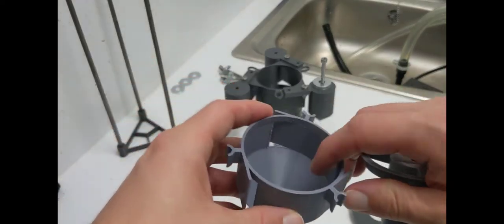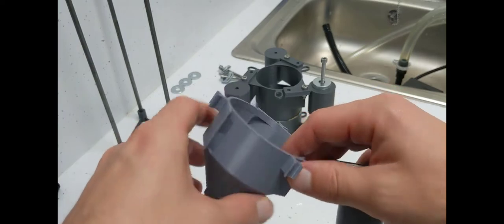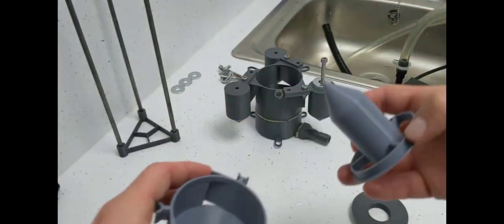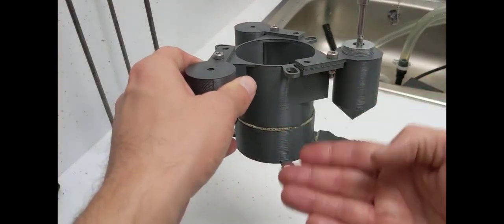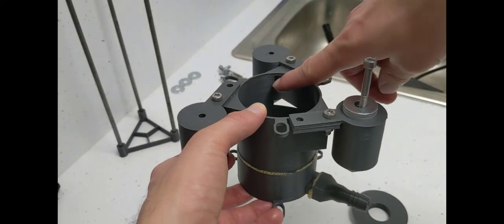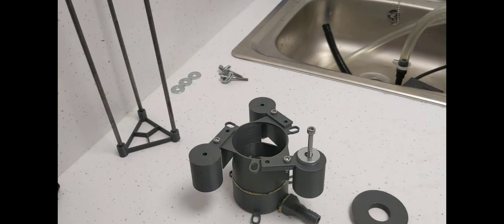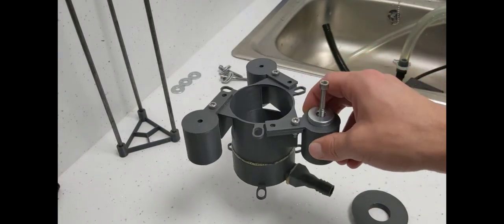With a strong vortex, air gets taken down with it. I tried fixing that with a spike insert but it didn't work — you just have to accept it. The solution is making the chamber as long as possible so there's a good volume for the vortex to spiral down. A bit of air goes through the pump but from what I've read online that's not a problem long-term unless you're taking a lot of air, which I'm not.